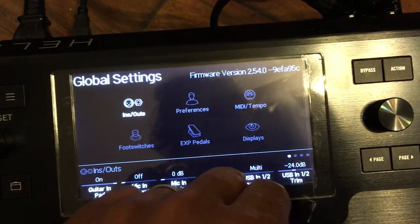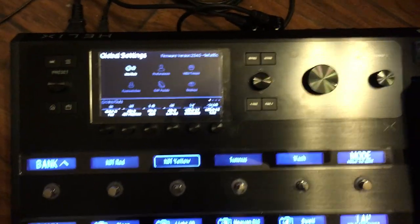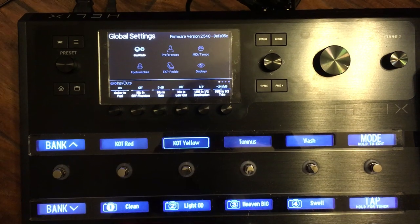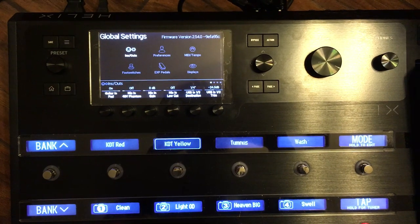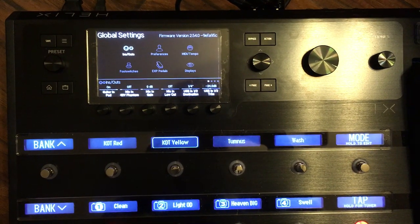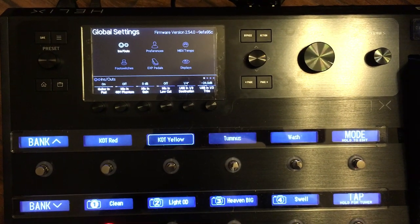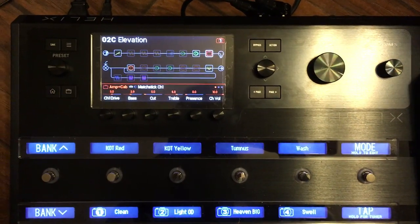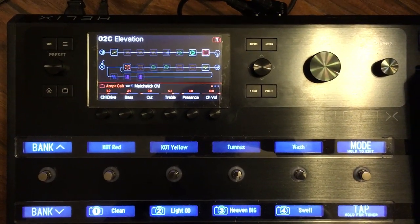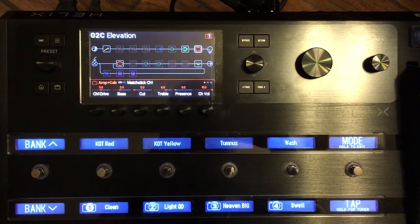It's really convenient for playing MP3s while you're on stage so the band can hear them. You can route it differently — send it to just your stage monitor if that's on quarter inch, with XLR going to front of house without the MP3s going there. What's really great about using this compared to using return jacks and adding return blocks to your signal path: you don't have to edit the signal path, it doesn't take DSP, you don't need block space, and you don't have to add it to all the various presets you plan to use. It's just always available.